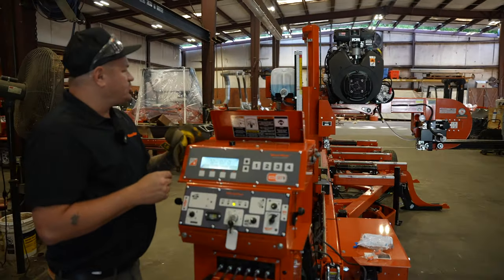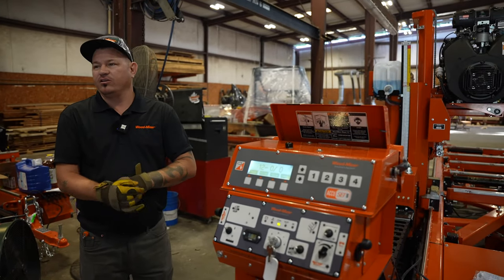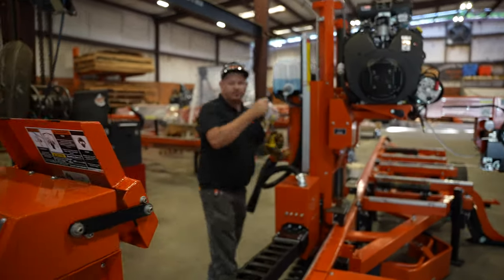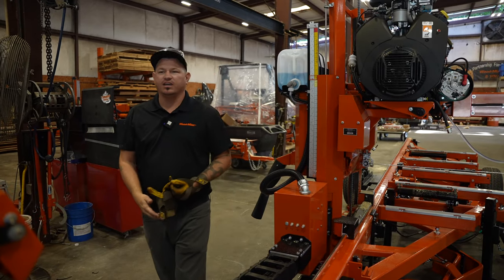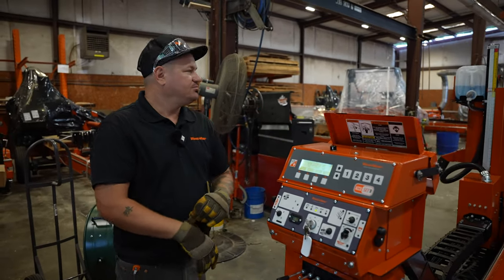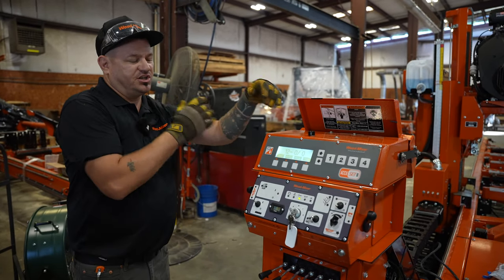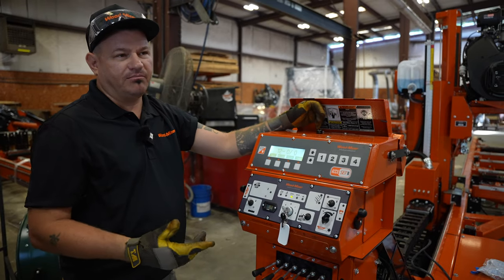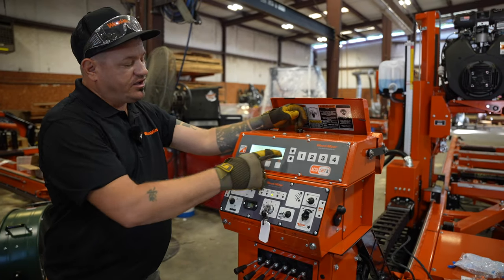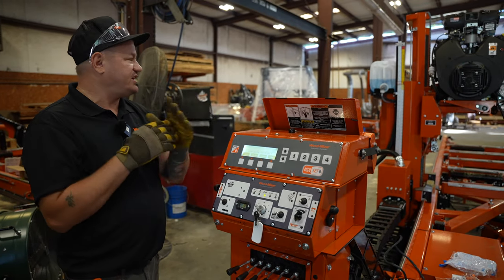Using 12 as my reference point — let's say it says 12 here but didn't say 12 on the scale. It's really easy to adjust: you just loosen these two bolts right here and move that guard up and down to get it where you need it. It can move about a half inch. If you press this up arrow, it's like my main menu button, and then you've got 'calibrate head' — that's how you calibrate that head to that scale.